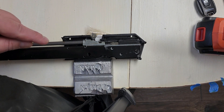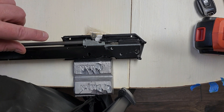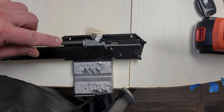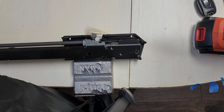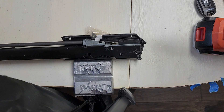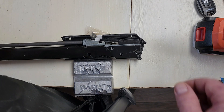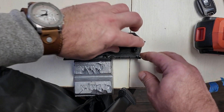The front hole is a little bit easier, but we place the valve body and barrel assembly in the frame and attach it to one half of the receiver to make sure when we drill the front hole, the standoff will not interfere with the barrel. Just like we did for the bolt slide, we want to place the standoff in that corner, making sure it's not pushing down on the barrel where we drill the hole. Once we drill those two holes, we can remove the frame assembly and remove the bolt.